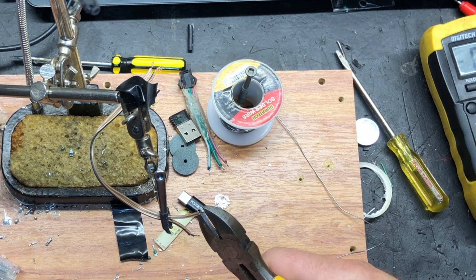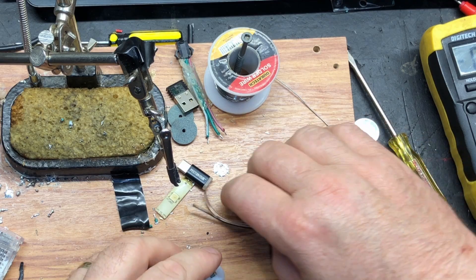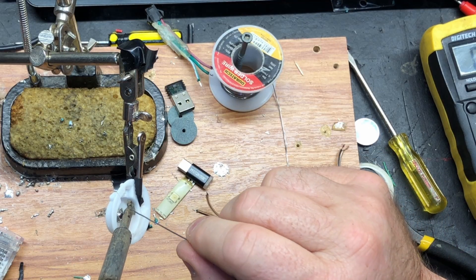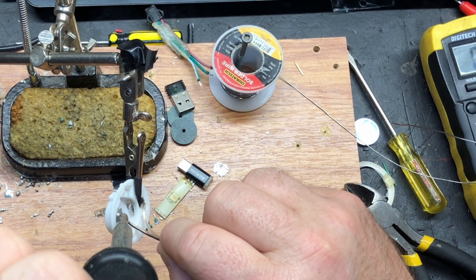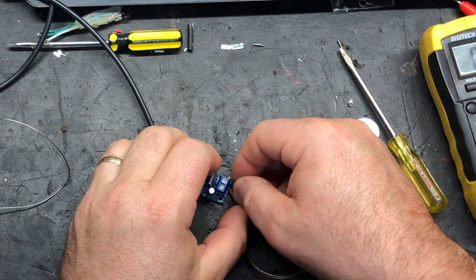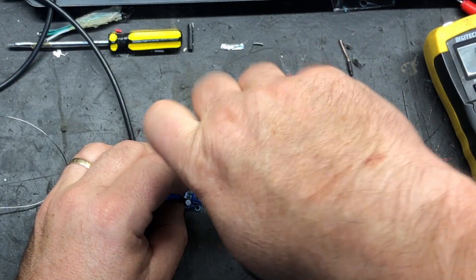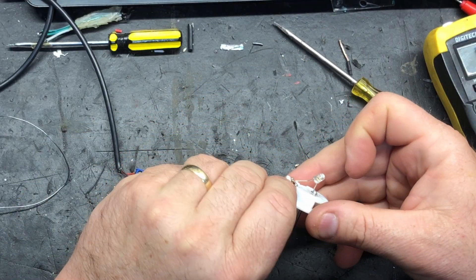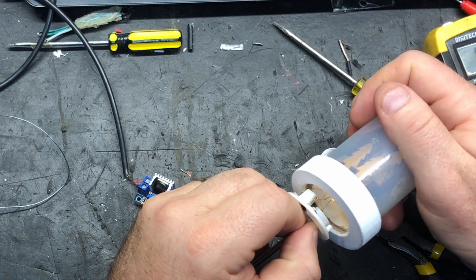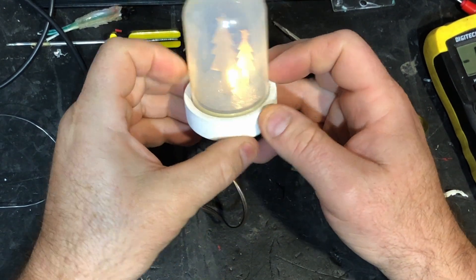And that's all we have — just one LED once again on a switch. We've got the negative in the middle and the positive back here on a switch. We are going to run a wire and solder it directly onto those two contact points. We strip the wires, I've got black for negative and the other for positive. Drop a little bit of solder on the center contact and a little bit on the side contact. Bring our wire in and do exactly what we did before — positive and negative. When we plug it in the light won't go because there's a switch on it. With a bit of luck, when I flick the switch, we get a little light.